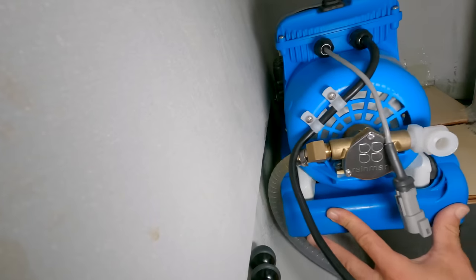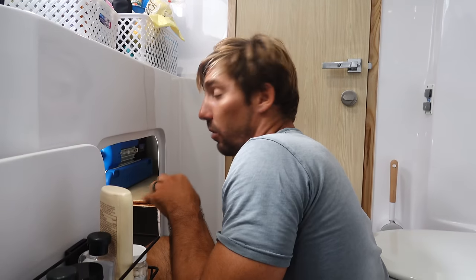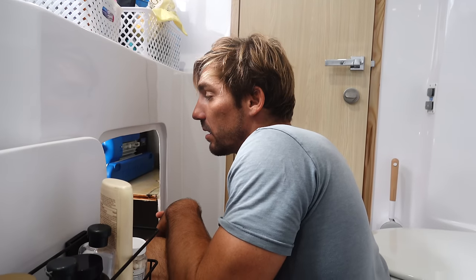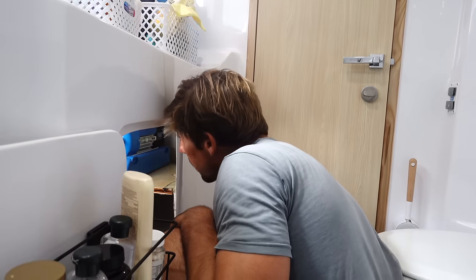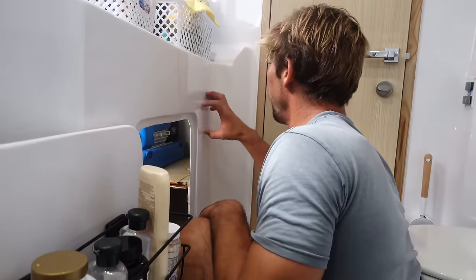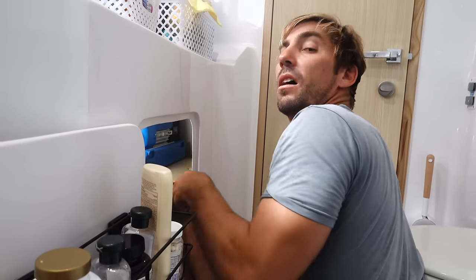So, wow, that fits perfectly. So this pump is air-cooled, so it needs some ventilation around it to keep it cool. They say you do not want the ambient air temperature around it to be more than 104 degrees. So in reality, when we run this water maker, we're going to have to keep this open, but that should be fine besides that. Why don't we add a little light vent that they have everywhere? Yeah, we could add a little circular vent right here. That'd be fine too, yeah.